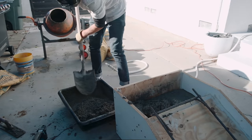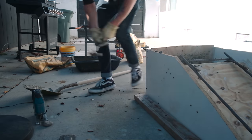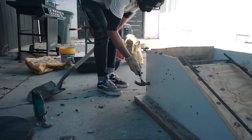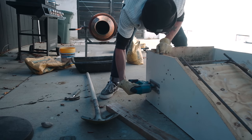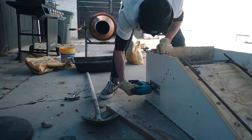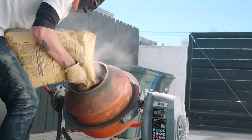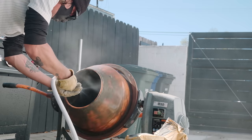While adding concrete, I'm constantly agitating the form using my hammer or a jigsaw with the blade off. You can really start to see all the oil and minerals come to the surface of the concrete — this is what will make it nice and smooth on the sides of the surface that we can't reach with our trowels. Now it's rinse and repeat — adding more concrete to the form and agitating every step along the way.